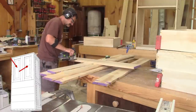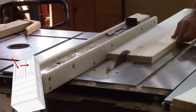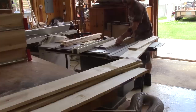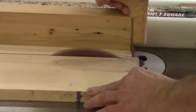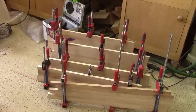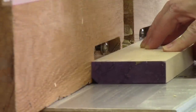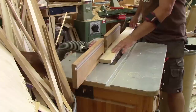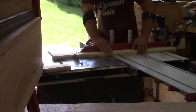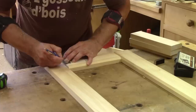I still need to take care of the top doors. The wood is already surfaced, but I still need to take care of the rails and stiles. I also need two raised panels. I glue more planks together because I'm missing a shelf. While the glue dries, I can work on the door frame. As a matter of fact, it's pretty much like the sides.